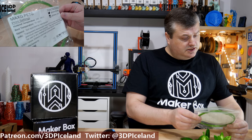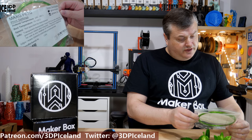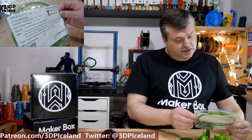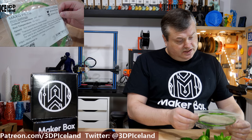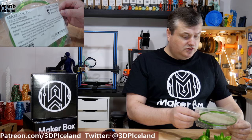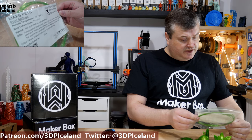It says here it's a transparent Xenomorph Green PETG, made using only premium resins and colorants. They recommend printing at 230 to 260 degrees with 70 to 100 degrees on the bed. Speed is not specified by the manufacturer.